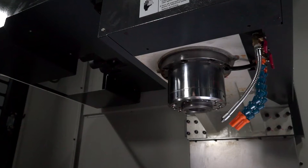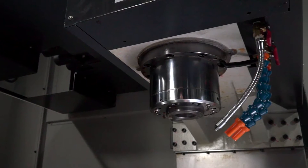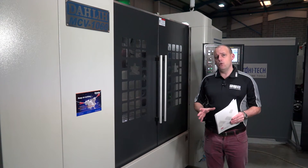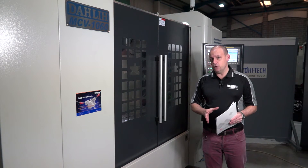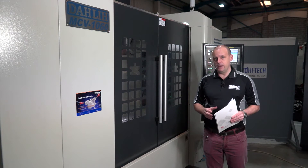The new FANUC P-type motor on this machine means you can get the benefit of machining at higher speeds but have plenty of power at the bottom end as well. Ward High Tech have told us that at just 10% of the spindle speed you can almost achieve the full amount of power, so you've got plenty of versatility in your spindle's capability.